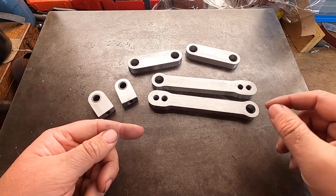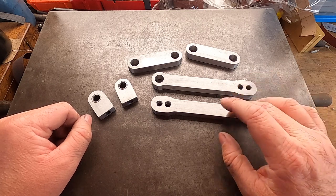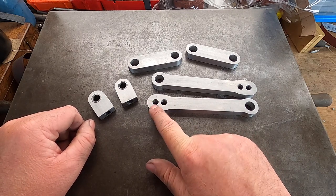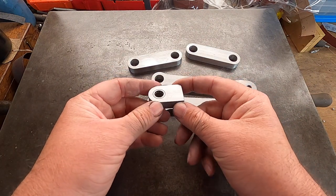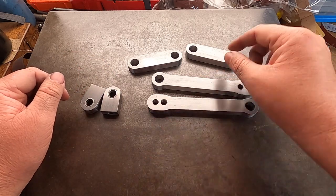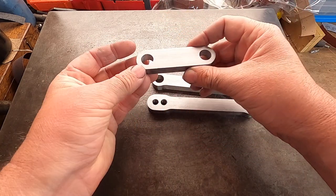So with the quick sand, like you've just seen in the time lapse, to get the black off — I'm going to help with that, because doing the connecting rods I ain't doing it this way again. So we've got the combination lever bored out to 14mm for the bearing, and the two M10s here. The top one is for the valve rod — this is the valve rod end. This is one of four; I need to make another two, but the other two are slightly wider. These are the cylinder end, so I need to make another two slightly thicker for this end. And then that's the swing link that goes at the back of the steam engine — again, bored out for the bearings. On the frames there's a slot so it can be adjusted. They've come out alright.